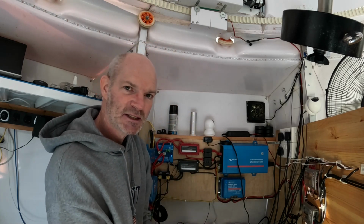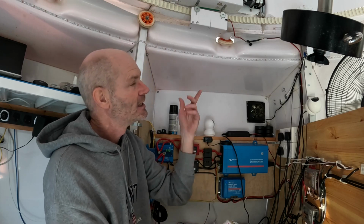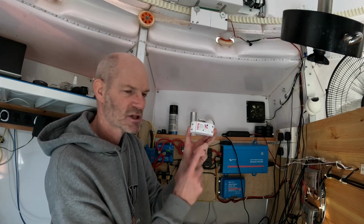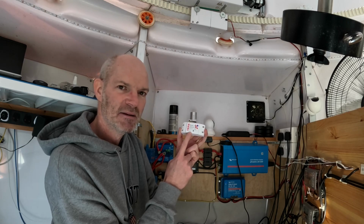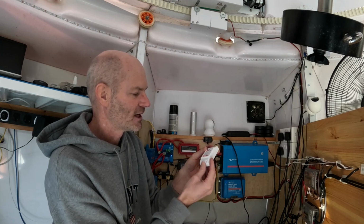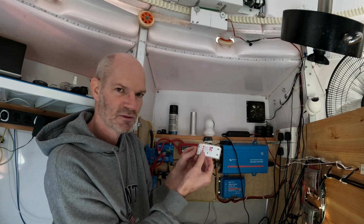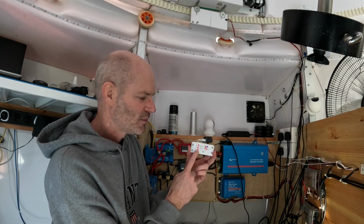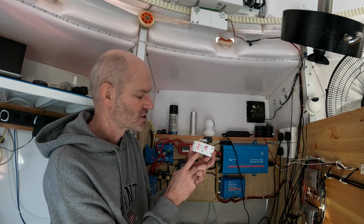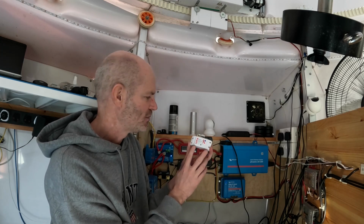And as I've mentioned in some of the previous videos, there is an issue where the shutter occasionally locks up its communications back to the rotator, and you've got to power it off and on again to get things going again. So I've got myself another Sonoff unit. This one's a single channel B2 basic R2. However, these are actually designed for using AC mains in, and then it just switches that power on the output, which is obviously no use if I'm doing DC. So I made a modification to this one to run it off of 12 volts DC. I'll put a link in the description to the article on my website detailing that modification.